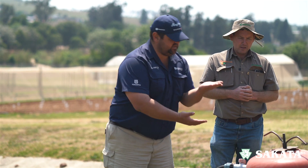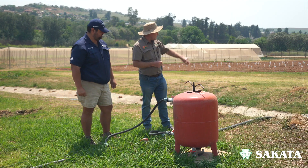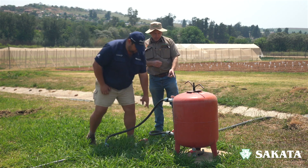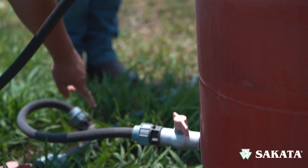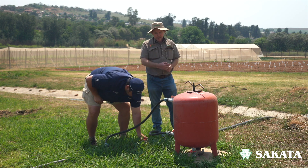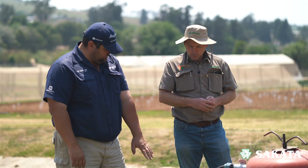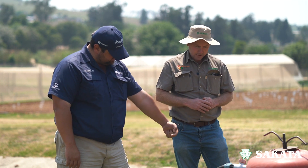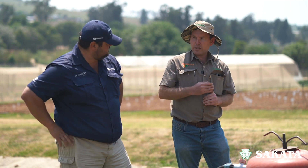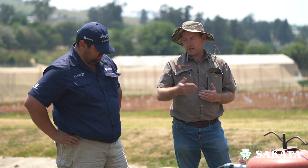The lid seals from the bottom side so when water comes in it pushes it closed. The main water comes in from the bottom tap — that's your water in. Then there's a valve in the middle: we close that a little bit to force water into the tank, and when the mixture is ready we open the top tap to send it to the block. I don't close the middle valve fully — there's still water going through — and water also comes from this side so you dilute the fertilizer and apply it over a period of time.